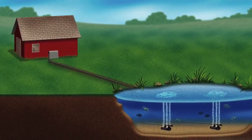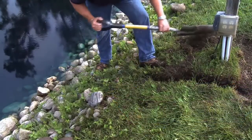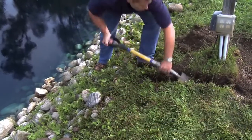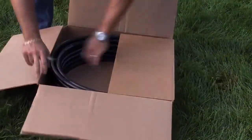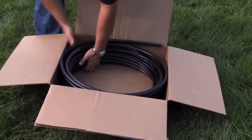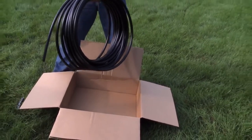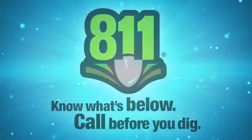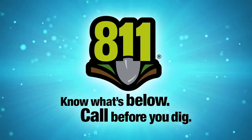If power is not available nearby and you choose to place your silent air cabinet away from the pond's shore, all that is needed is a shallow trench approximately 8 inches in depth and AirMax Direct Burial Airline, sold separately. AirMax Direct Burial Airline is designed to be placed directly underground without the need of a PVC pipe or other protection. If a trench is needed, AirMax highly recommends that you call and have your underground utilities located and marked before you start any digging.